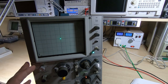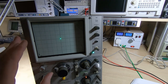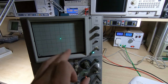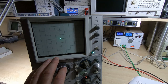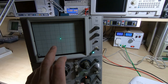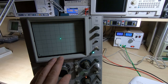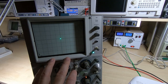I checked the compensation — that was fine. I'm not going to show it in the video as it was a very long-winded and tedious process but it didn't need adjusting. The next adjustment is polarity balance, to make sure the dot doesn't move around when certain settings are changed. This is an analog machine, so there's no auto zero like you'd get on a digital machine. As various circuits are brought in, they need to be compensated to make sure they don't cause any offsets — otherwise you'd be constantly having to readjust the instrument. The various adjustments pre-empt that and make sure the display is consistent.